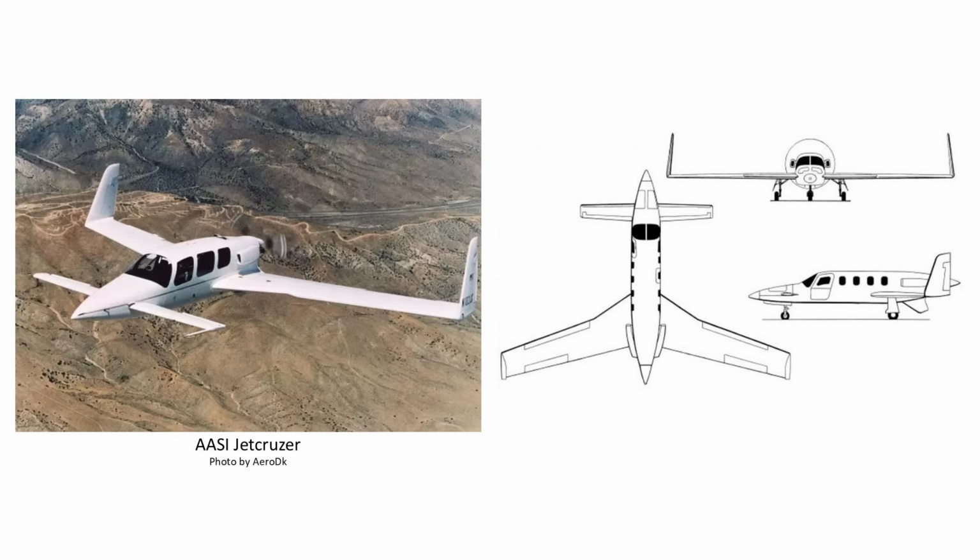Interestingly, if a canard is added in post as an existing aircraft performance improvement, the foreplane will add lift ahead of the CG, meaning that downward elevon will be required to trim properly, which then means that we're adding lift both ahead of and behind the CG, which further reduces the takeoff distance.